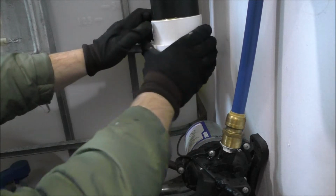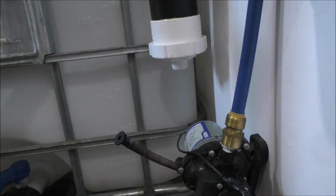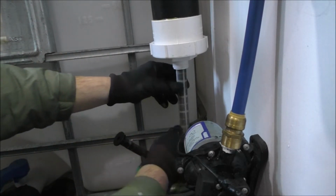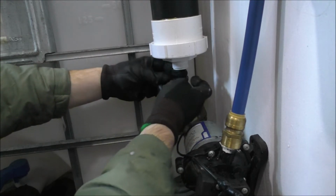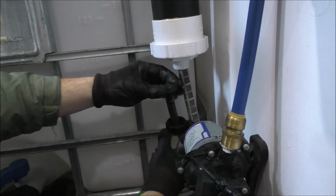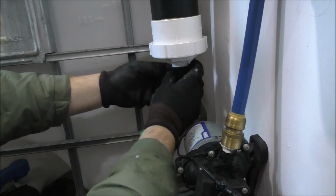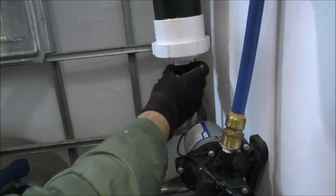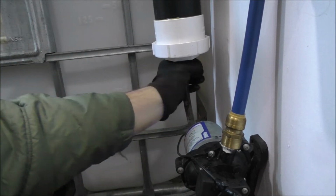And the purpose of the ball, guys, is when this compartment fills up with water, the ball goes to the very top. And what happens is it kind of dams off the water flow up there, and from there it starts storing water. Okay, so the orifice is in. Filter's going up. And we just tie this up, thread this up in there, and we're all set for the spring, summer, fall season.